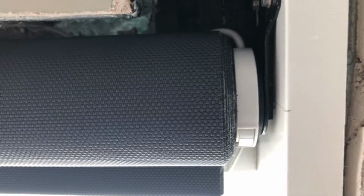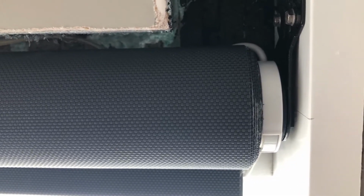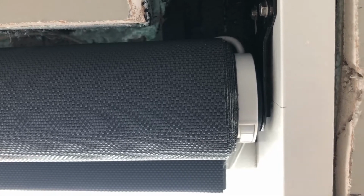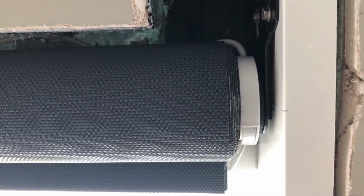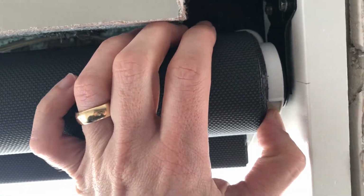When we look at it closely, we can see as it rolls up, it's telescoping to the left. We can make an adjustment to that as long as everything's already level and square. There's some misalignment in the roller. We can make some adjustment to that just by adding some tape at the very end. You can push this button. That'll start it rolling down.